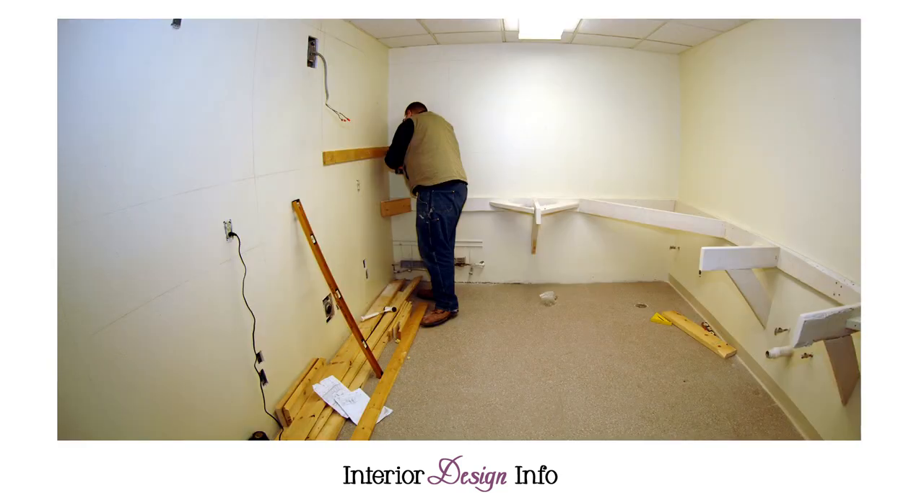The fifth way to hang heavy items on a wall is to use horizontal wood bracing. For hanging items over 100 pounds, such as kitchen cabinets, you may need to add horizontal 2x4 or 2x6 wood bracing. The wood bracing will need to be added either behind the drywall and securely attached between two vertical wood studs, or on top of the drywall and firmly secured to wood studs. You may need three sections of bracing: one at the top, one at the middle, and one at the bottom of your heavy item. The horizontal bracing will ensure that all fasteners go into wood and not drywall.